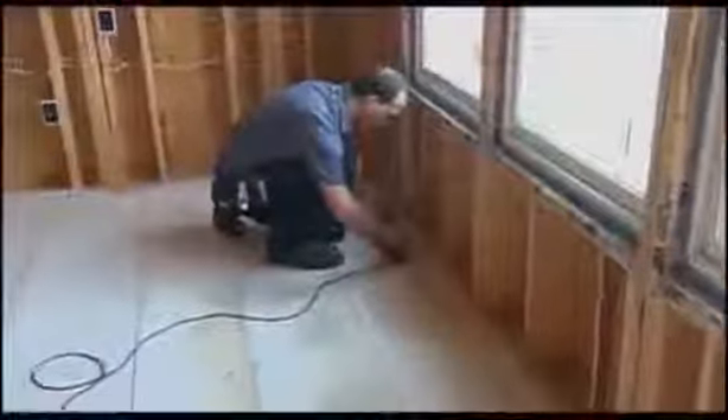The first thing we're going to do is plug all the vents in the house, which is what we're doing right now. Next, we'll bring all of our equipment downstairs. We're going to cut a couple of holes in the duct system — one on the supply and one on the return. That's how we tap in our equipment. Over there is our machine, called the HomeSeal machine, which is what we use to inject the sealant into the system.